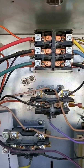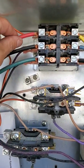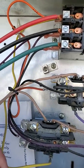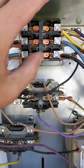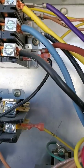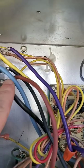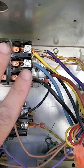One recommendation if you're just starting out and don't know where all the wires go: get the new contactor, put it aside, and start with one wire at a time — take one off and put it on the new one in the same position, like for like. Put the middle one in the middle, green on the bottom. Do one side first, then the other. Red on top, black in the middle, green on the bottom. On the other side, black at the bottom, blue in the middle, yellow on top — just go like for like.